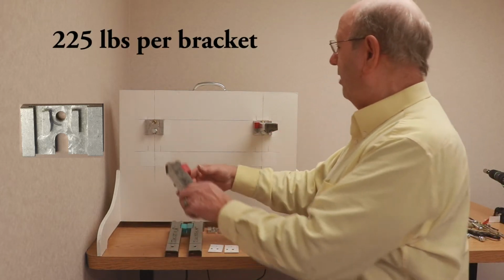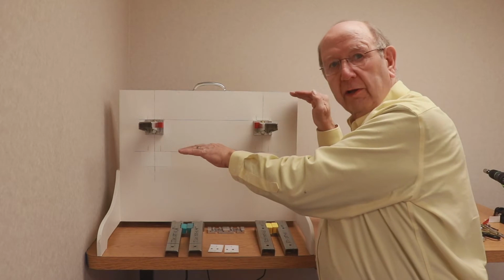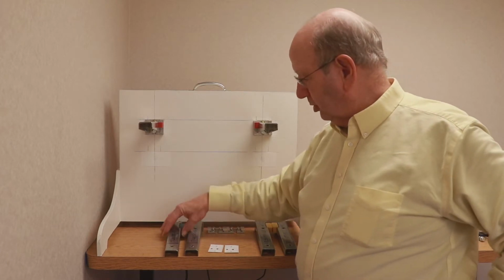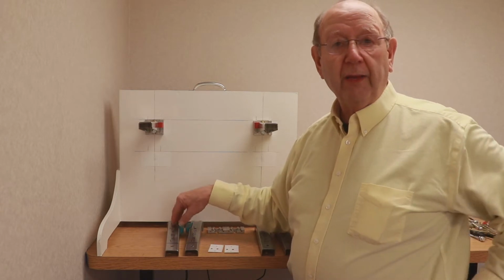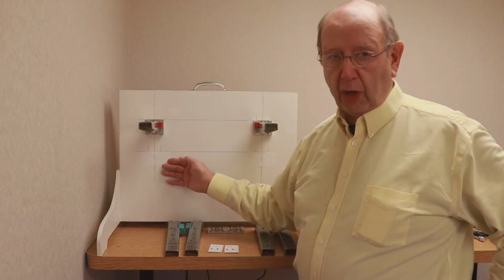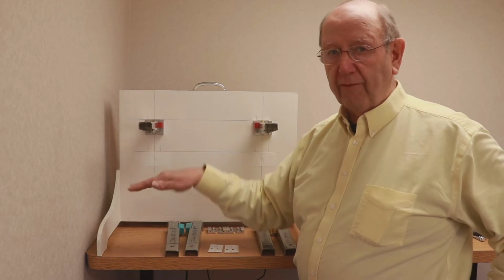So it's a simple matter of putting the plate on the wall and then installing the brackets. Slide on the floating shelf. Good system. What we're going to do today is demonstrate installing this T-Loc 15-10. Now it will handle up to 150 pounds. They all install the same way. The T-Loc mounting plate goes against the wall, and then you attach the shelf bracket to that. And you've got some adjustability for tilting your shelf, and that's a good thing.